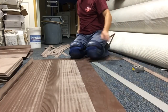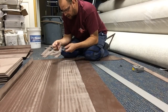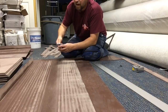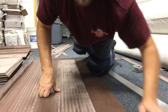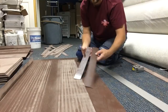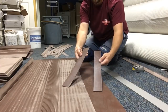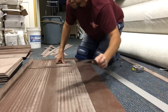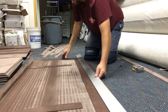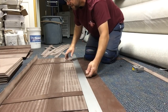I guess this was my woodworker coming out in me, because I do this at the shop if I'm making a lot of the same kind of cuts. I actually cut me a couple pieces. I'm cutting these down 17.5 inches, so what I did was cut these to 17 3/8. And I just set them right there. There we go, now you can see better. They're little spacers.